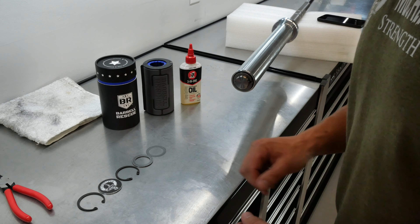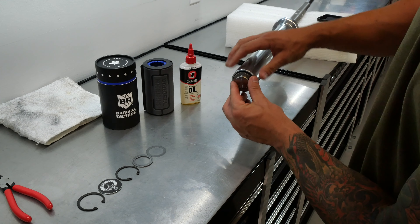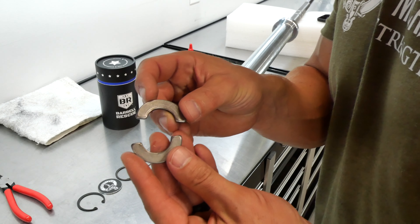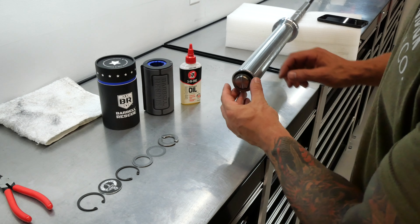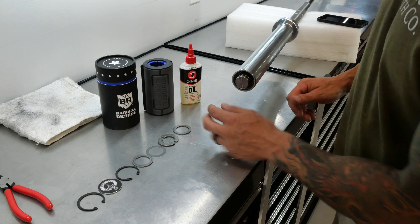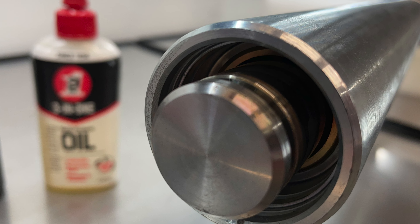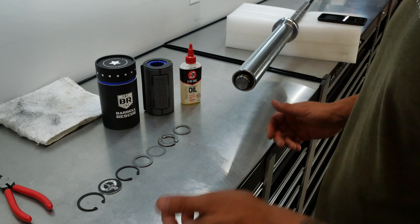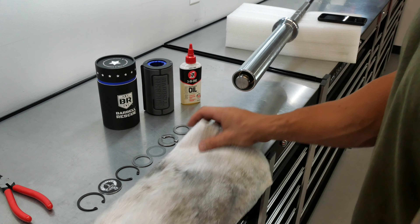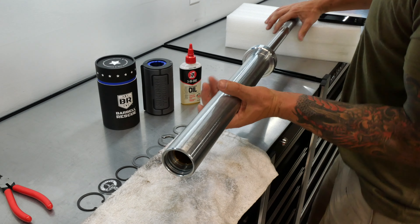Just make note of that as you take them apart — everything comes out in the order that we took it apart. Now you're going to bump your sleeve and push it inward, and then we can continue to disassemble. There's going to be a washer here, so we'll go ahead and remove that. We're done with our snap ring pliers for now. And then this is a shim — you can see that's very thin. That shim came out next. And now you've got a set of split collars here. Push the sleeve down a little bit more, pull off the split collars, and now we have another washer.